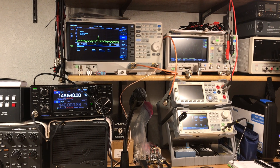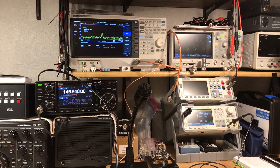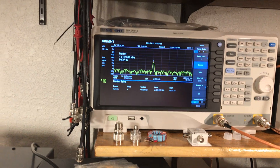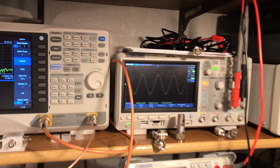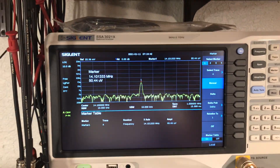A little tedious, but one of the big challenging steps was calibrating the S-meter, because the S-meter requires 50 microvolts of RF signal on the antenna terminal. That is really small — the scope can't reliably read down that low, but my new Siglent spectrum analyzer certainly can.